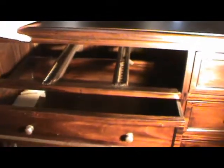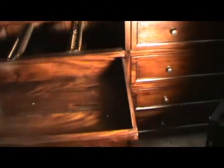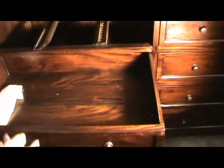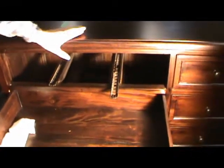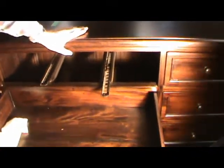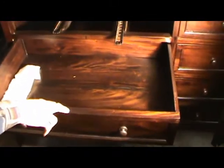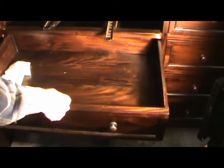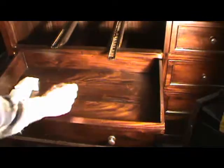We're looking at the metal rail system. One of the problems we've noticed is that most of the drawers were not sitting in the grooves, so the doors were flopping around. I don't think that came off during shipping — I think they were never on. There's an awful lot of play here, and I can see where a customer, just by leaning on this a little bit, could snap this whole thing off.